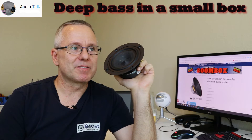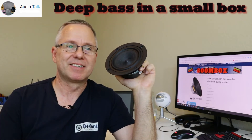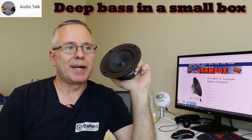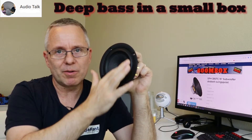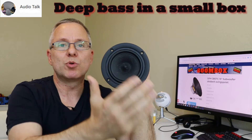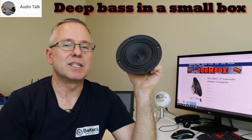And that is fully understandable. It would be nice that there's nothing to look at, and it's just there — it's just bass, and lots of it. So, how you achieve it in a small box is by having a relatively small cone — this area, the membrane here that's moving the air. And then you need a long throw; something that can move a long ways. A long X max is what it's called as a Thiele-Small parameter.